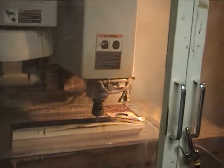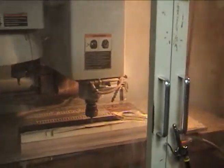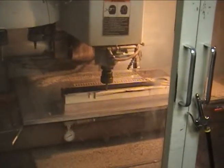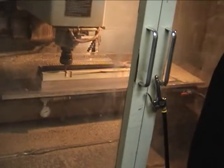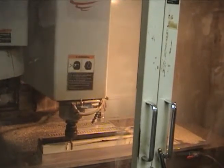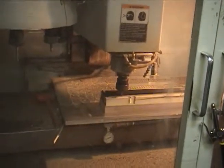What he does is he uses a jump drive off of his computer, and we put it there and do what's called DNC, direct numerical control. So those computers are running that machine. Because these things have some memory, but it's very small, so you're better dodging that memory and going straight to DNC. You have to recalibrate these things with those relays.